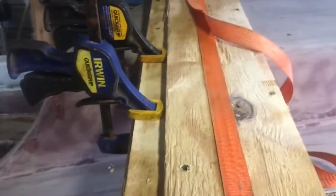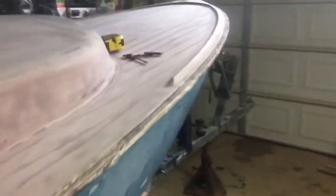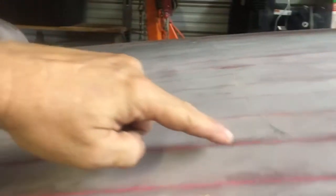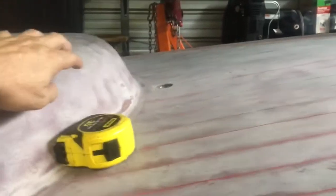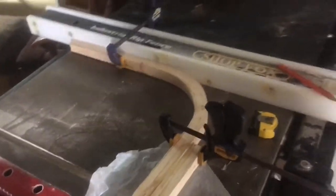Whether I'll trim this part off I don't know — that'll come in the fitting. We do quite a bit of laminating around here, and I want to show you another one that I actually messed up on and had to fix. If you look up in front, you can see a bulkhead right up in there — it's solid with some flotation. Our cheeseburger-loaded sailor apparently spent too much time bouncing right here. You can see a very fine surface crack in the gel coat, and this forward part of the cabin is down about half an inch further than it should be.